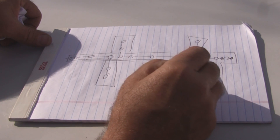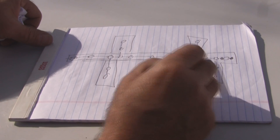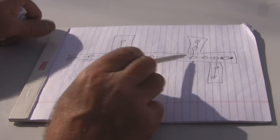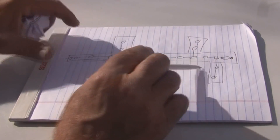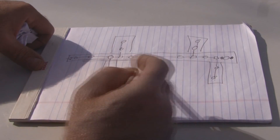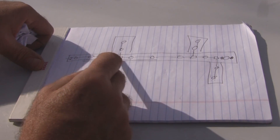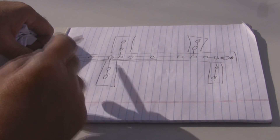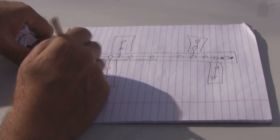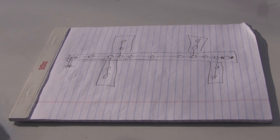Then you come back this way, pull a little loop down into that box where that detector is going to be. Then you come to this next branch and do the same thing — pull off 80 feet and go back out that way and back. So you work the whole thing backwards: little loop, little loop, little loop, big loop, big loop. Then you come back to the panel, cut off enough to make up in the panel, and you've got exactly what you need.